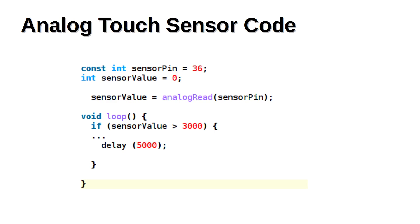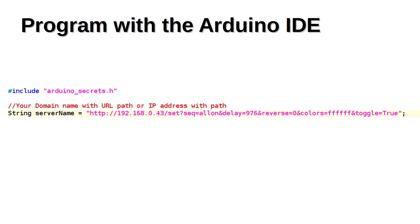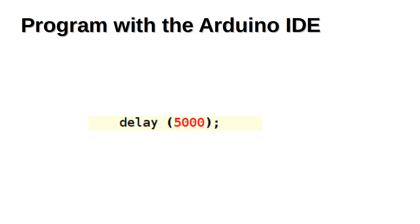The part to detect the touch sensor is quite short, just reading the analog input. Most of the code is used to send the web request. This shows the URL that sends the message to the pixel server — it uses a new toggle feature specifically added so this can toggle the LED state without the ESP32 first needing to query whether the LEDs are currently on or off. The IP address is specific to my pixel server on my LAN, so you may need to change that for your own network. You'll also need to put in the wireless details for your local Wi-Fi network. I've used a delay as a rather crude debounce to prevent multiple triggers when you bring your finger close.